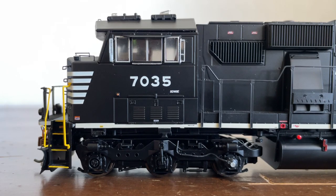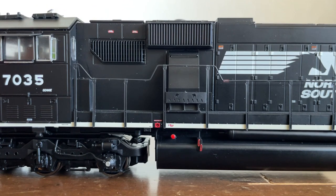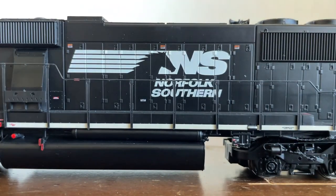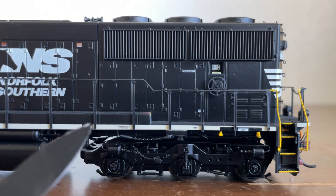Now we're looking at the conductor side of the locomotive. We have a sunshade right here and a four-window piece side window, some electrical boxes, our number 7035, here it says SD60E, and there's a nice big F to indicate this is the front. The very good-looking truck detail right here, as well as the speed indicator. Here is a jack pad and there is the E-bell. You can see those steps right here and the end of that thoroughbred. This part right here is the dynamic brake fan. I'm not sure what this other part is — if anybody who knows NS locomotives please let me know — but this is a blower right here. Moving on to the fuel tank, you see a big nice fuel tank with an air tank reservoir. There is our Norfolk Southern logo with the horse head, Norfolk Southern — NS. And as we move along, you can see the horn there and the brake wheel right there, as well as more truck detail including the chains for the brakes.